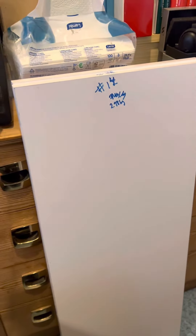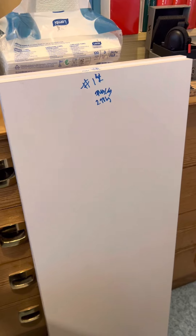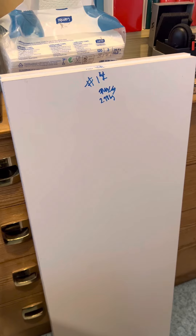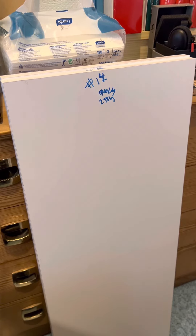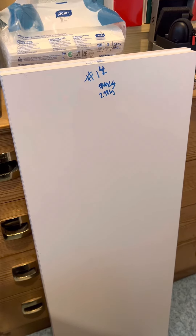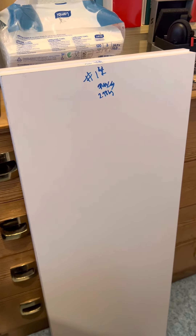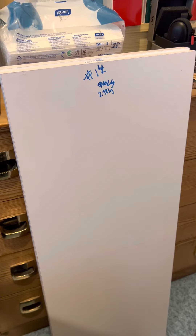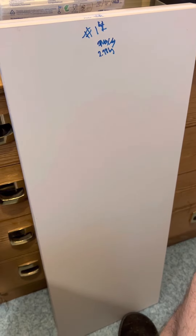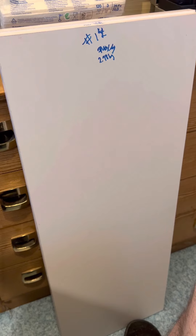Now I do the test of the width of the plate and then the length of the plate. It's interesting to know that often particle boards, OSB strand boards, or materials in general like extruded polystyrene are not isotropic — they are usually orthotropic. The sound speed will be different in the different directions of the material.